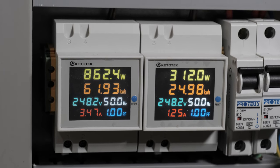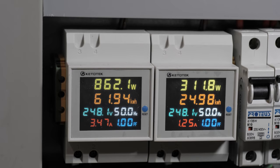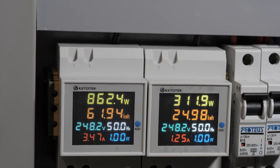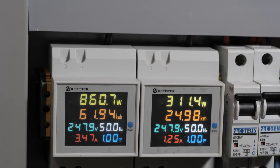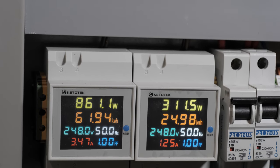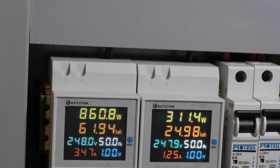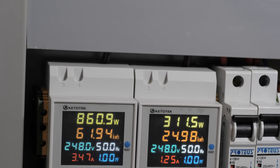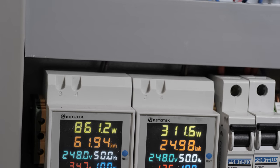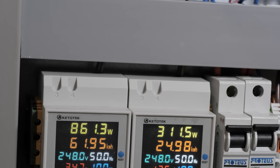I've got 1 or 2 smaller ones, that's why I think the small one is working on the right-hand side, and on the left I've got 2 large ones working. It tells me that it's putting 3.4 amp on one side and 1.2 amp on the other side. As you can see, my breaker here is a 10 amp. I don't know what would have to happen for the breaker to actually go off. The heater cable, which runs all the way to the heater, has an additional fuse. Each heater is going to pull about 1.8 amp, if I remember rightly. So even if the heater goes, it's going to blow the fuse along the line. So I don't think so.